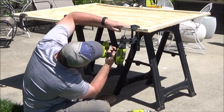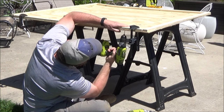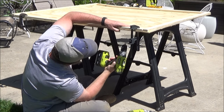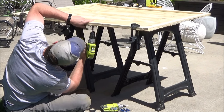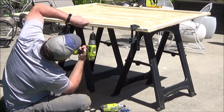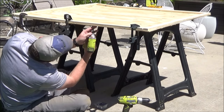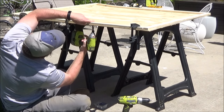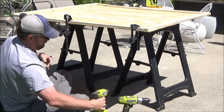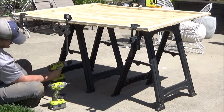As far as the lid goes, if you want to keep the cats and debris out of your sandbox there are a lot of ways you can go. I just made a really simple lid out of quarter-inch plywood framed out with 1x2s. I bought two 8-foot 1x2s and cut them in half. The nice thing about this sandbox size is you can buy plywood in 4-foot square pieces if you don't want to cut it, but I bought an 8-foot piece and cut it down so I'd have some extra.